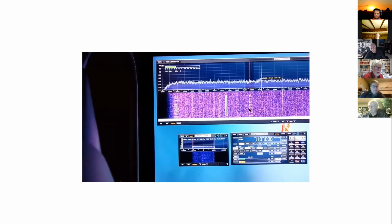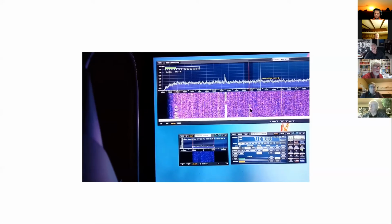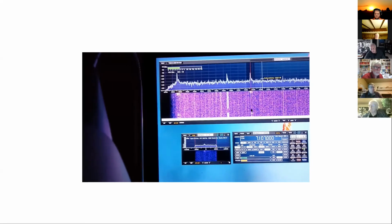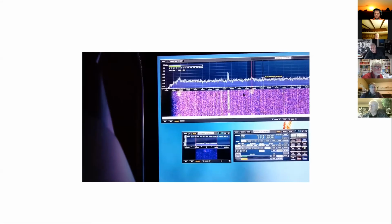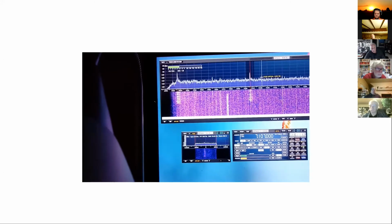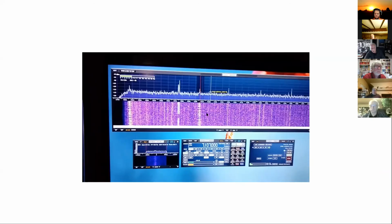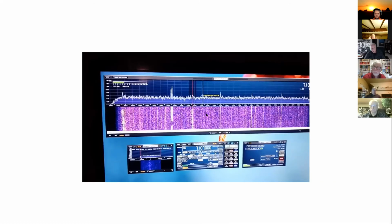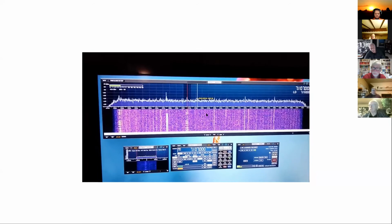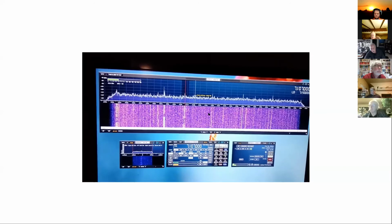Also, KJOE, the Beaver station, KJOE, which is real close to where I am too, is mixing in with these signals. And so what's going on here is basically, look how strong. See, it's very intermittent here. The strength of the signal here, just coming up now, and you can almost start hearing the modulation. So it's broadcast interference and it's creating all kinds of spurious mixing signals and getting in all over the place.